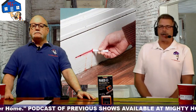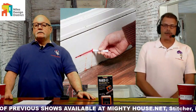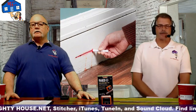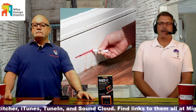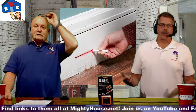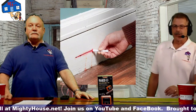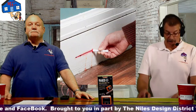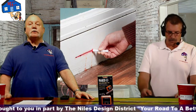If the work area is confined to a hallway, you'd plastic off the other doorways and seal them up so dust doesn't migrate through the rest of the house. Air scrubbers help control dust too. The fascinating thing about teaching this was that I had to instruct people to protect a work area so dust didn't migrate — any good contractor already does that. But not every contractor does, and if they're not containing the work area, you've got the wrong contractor.